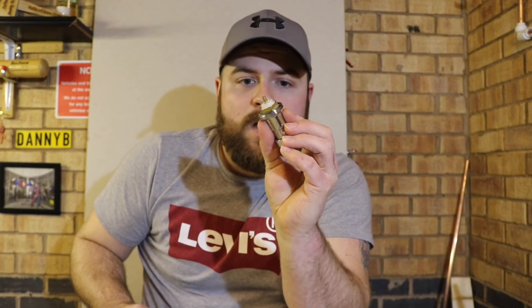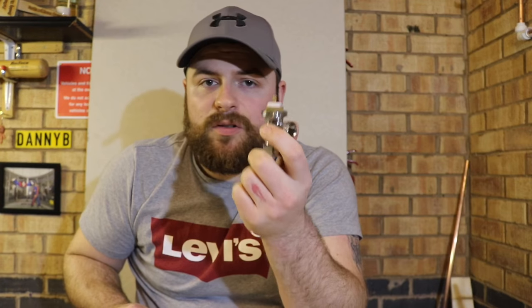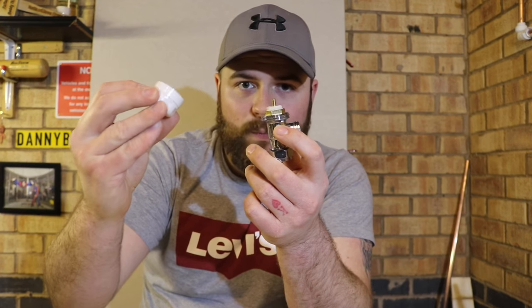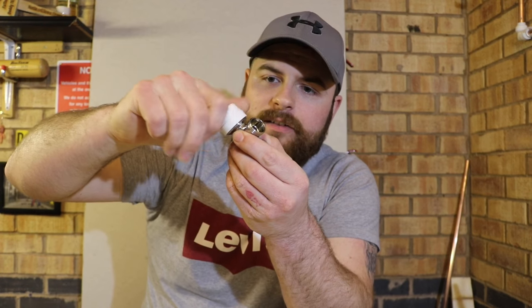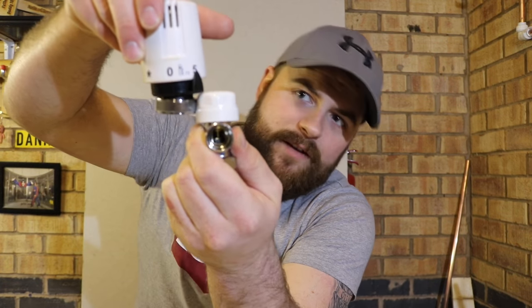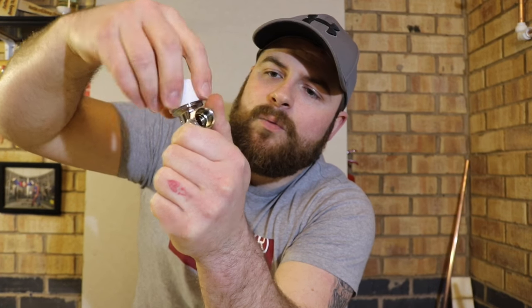Let's say you've taken the head off to decorate and left it open — well, that's open. Once you turn everything back on, it will find that it needs to call for heat, and before you know it you'll have water spurting out. So by all means take them off to decorate, but make sure that you've got one of these caps. It just sits on nicely and acts like a lock shield cap on the other side of the radiator, keeping the valve shut. It's a quarter of the size so you can decorate around it. Do not leave it open-ended like that once the system is full of pressure.